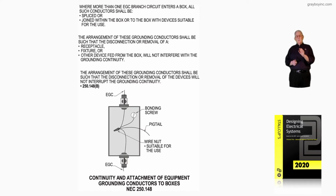Now, reviewing the call-out information right above the receptacle, it states this isolated equipment grounding conductor shall be permitted to pass through one or more panel boards without a connection to the panel board grounding terminal as permitted in 250.146(D) as in dog and 408.40 exception. Now, basically, you can review this illustration, and you notice the isolation ground, the IEGC, is not connected to that metal box. It passes through it.